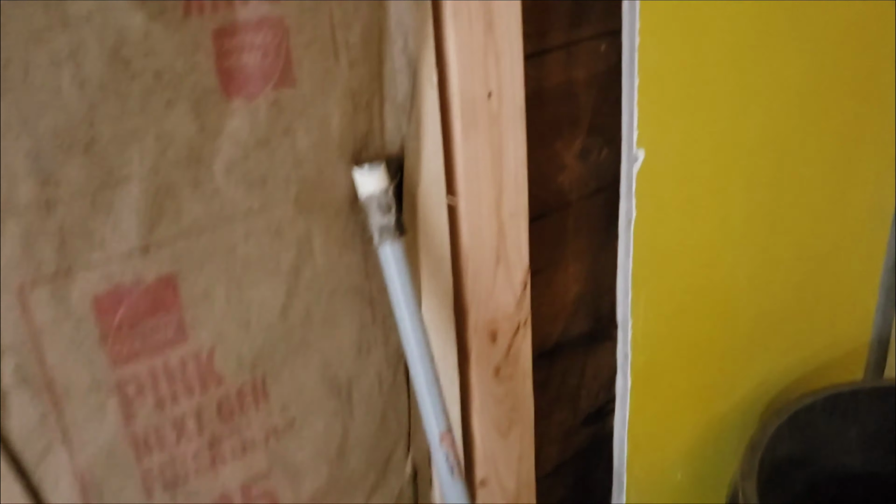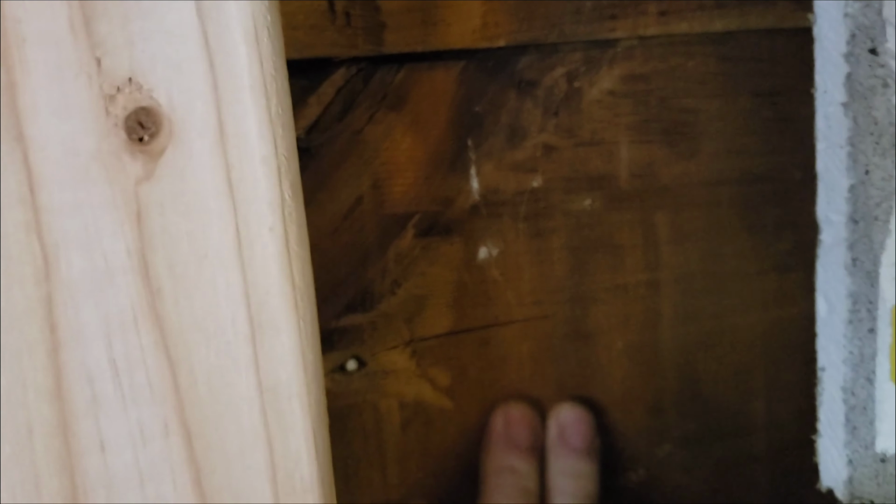And here is a joist bay where he's got to fill that with insulation. This here is the outside original wall. This is looking pretty nice. It looks like he cleared away a little more here so you can see he had to do a little shimming up there, those little slivers of wood, to get all the joists to land appropriately. All this ceiling material is going to come out of here eventually and we'll put new stuff. These are the fasteners sticking through, so those have to be cut off. See them right there. It's pretty awesome. This is looking good.